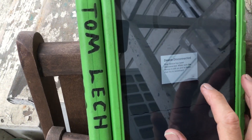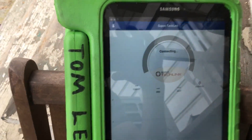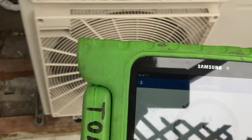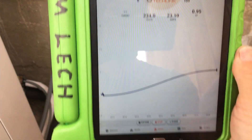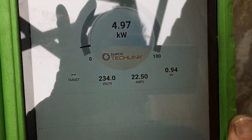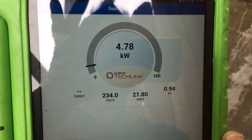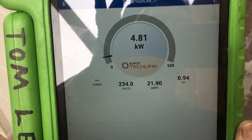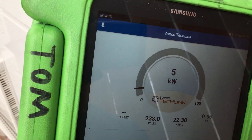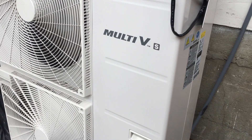I'm reconnecting — this is going to the Field Piece Connect and to the Red Link amp meter. We were data logging but I disconnected because I was playing with things. Everything can be data logged and recorded right here. We know we're at 230 volts and this thing is driving really hard — we have it maxed out in test mode to get all we can out of it intentionally. We're drawing 21 amps, and usually this thing only cruises at 12.